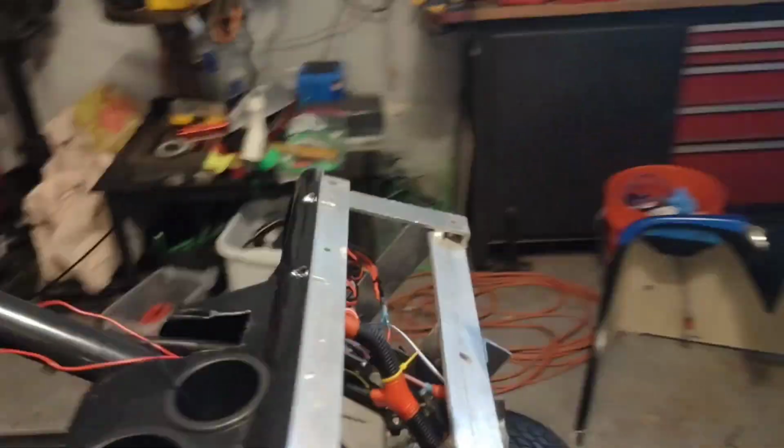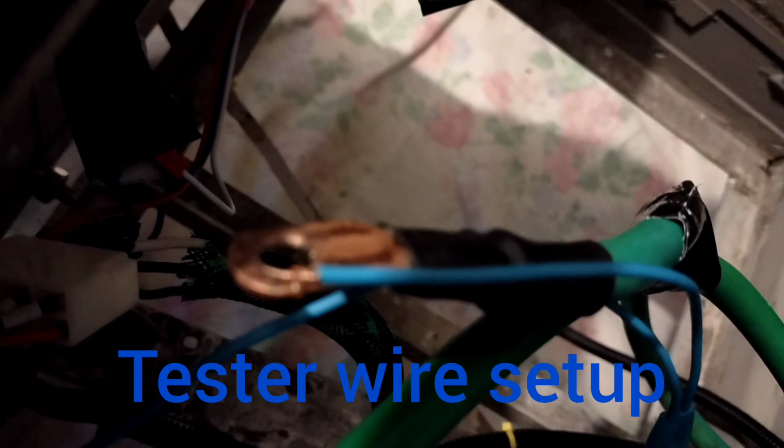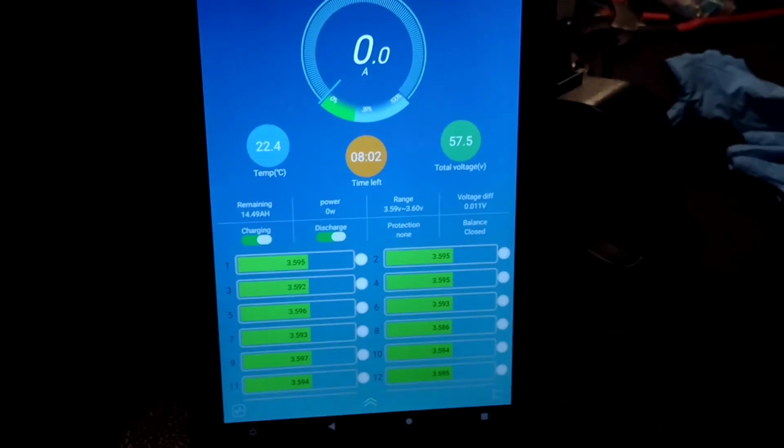Oh yeah, so I'm gonna go over here so you can actually see it spin. There's the wheel. Okay, so I got them backwards. So I need to flip around the forward and reverse contactor because I have them marked differently. Oh, and I just popped the fuse. Looks like we're good though. All right, so I blew a 15 amp fuse, goosing it, being stupid, because I just got this little tiny wire. I even got it just rigged up on that. But that's enough for testing because it's just free spinning. It's just off the wheel, or just spinning the wheel. It's not actually on the ground at all.